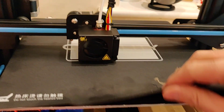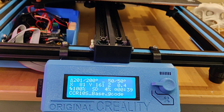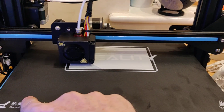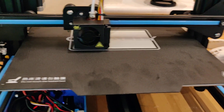The magnetic bed is just off AliExpress. I've had to enable mesh bed leveling in Marlin because this bed is not flat at all — all the corners are very high and it dips in the middle, probably about half a mil to a mil out all over.